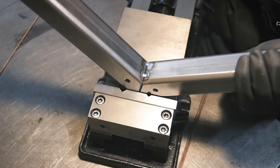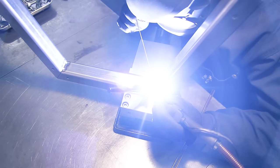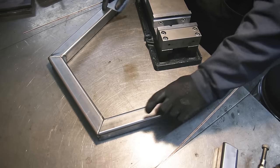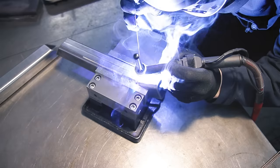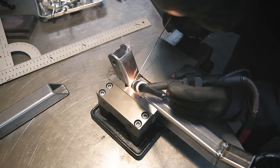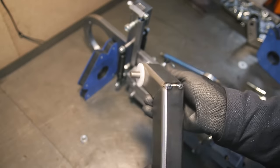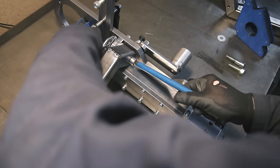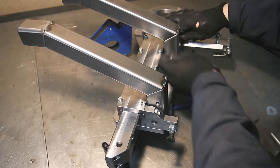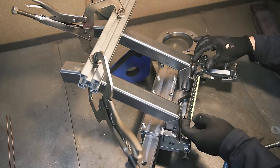The fact that I'm using a machine vise for this is probably going to ruffle some feathers, but at least I'm not MIG welding in it. And here you can see it actually comes out nice and flat. I'm tacking up all the smaller parts into bigger segments now, making sure those are straight - which is much easier than trying to get a whole bunch of stuff lined up all at once. Adding some plastic washers here because I don't want steel rubbing on steel. Now I'm using the grinder itself as a jig to hold these things where they need to be, which saves me a whole bunch of measuring and aligning. Clamping a straight edge on there to keep these things in one plane, and then I can tack this little bridge in between them.